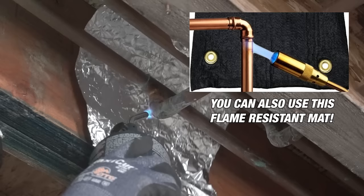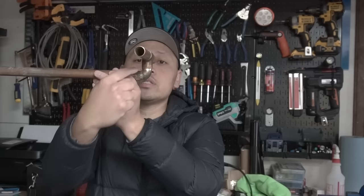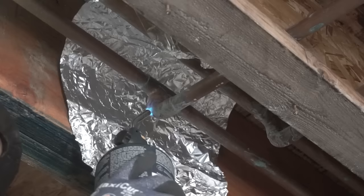As you've noticed, I put that flame underneath the piping and still it wasn't disconnecting. The reason for that is that even though we drained the system from the bottom, there was still standing water left inside that pipe. This was the actual pipe and we ended up cutting in 3 places. There was still standing water right inside here and up here. So even though we started directing the flame up there, it wasn't getting hot enough for the solder to disconnect.